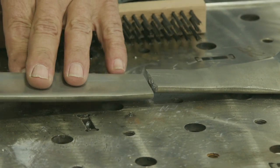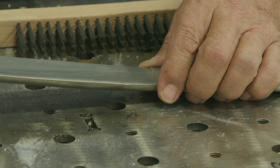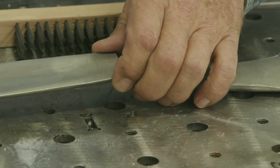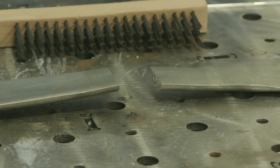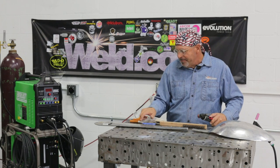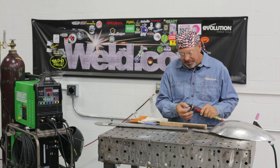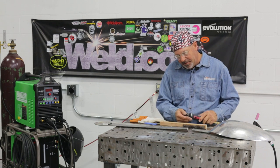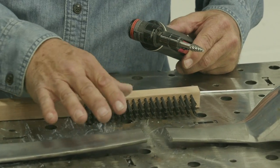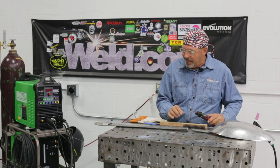The attempt here is to maintain this break. It's a pretty fine break. So I want to get this thing tacked up, and then I want to go into it and open it up with a carbide burr. I have a couple of carbide burrs here from Ferd — it's an Inox cut. I want to go in here, open this up, bevel it slightly so I can get down into this and get some weld metal in it. I'm not sure how we're going to finish this off — if they want to see the weld or if we want to blend it back. I'll know more when we get there.